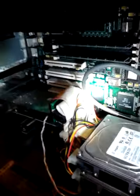And then that goes to just some power connections. That is the voltage regulator for the processors. The one up above it is integrated for one processor that you would obviously have with the motherboard. The second is optional for the second processor, which you could add.